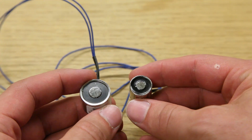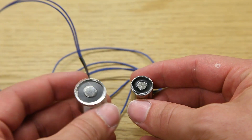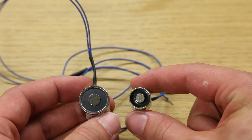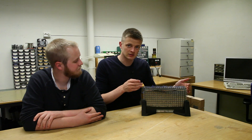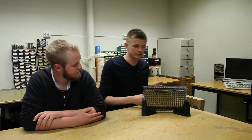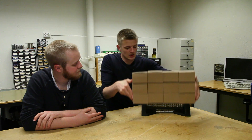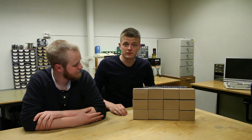When it came to choosing what magnets to buy we had some things to consider. We wanted as many and small magnets as possible to achieve something close to a 16 by 9 ratio and have a relatively high pixel density, but at the same time be able to lift the ferrofluid and stay within a budget. As it turns out, smaller magnets are actually more expensive. In the end we narrowed down our options to a choice between relatively cheap 20 millimeter magnets or smaller but more expensive 15 millimeter magnets. The width of the display using the 15 millimeter magnets is 31.5 centimeters; with 20 millimeter magnets the width would have been 42 centimeters, which is two centimeters larger than our boxes. So we went for the 15 millimeters.